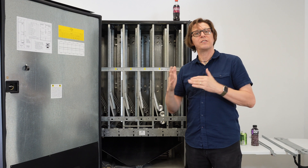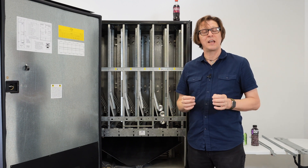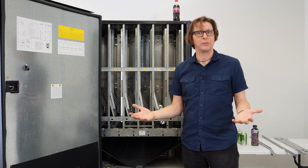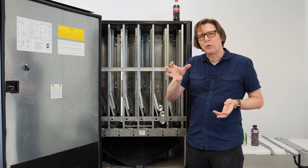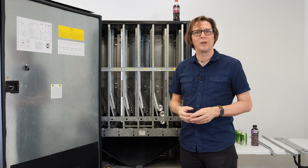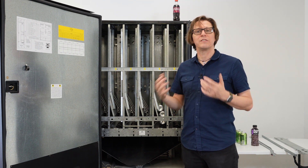By adjusting our set depth numbers, we're changing how quickly that motor stops. Since we're loading two deep on a 12 ounce can, that motor needs to stop instantaneously because if we allow it to coast after the product has dropped, the next product would drop in behind it and we'd get a double vend. On bottles, we only have one product deep, so we can allow the motor to coast — but because the motor has to rotate longer to come back around to grab the next bottle, we set it to a depth of one.